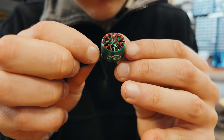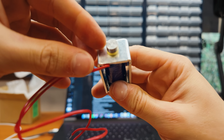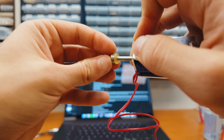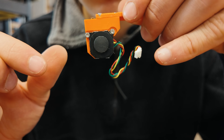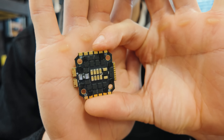In terms of electronics, we're using 1408 motors at 3750 kV made by an OEM. The solenoid is a semi-custom order from China — I changed some things about the standard design: it has lower internal resistance, is very thin at only 20 millimeters, and has a rubber end stop with a very wide head for better durability and impact resistance. The joystick is a BSP 1000. The ESC is a 35-amp 6S board from Diatone, flashed to AM32 — which is quite a pain to do but definitely worth it. It's the only ESC that would fit inside with the right voltage and current ratings.